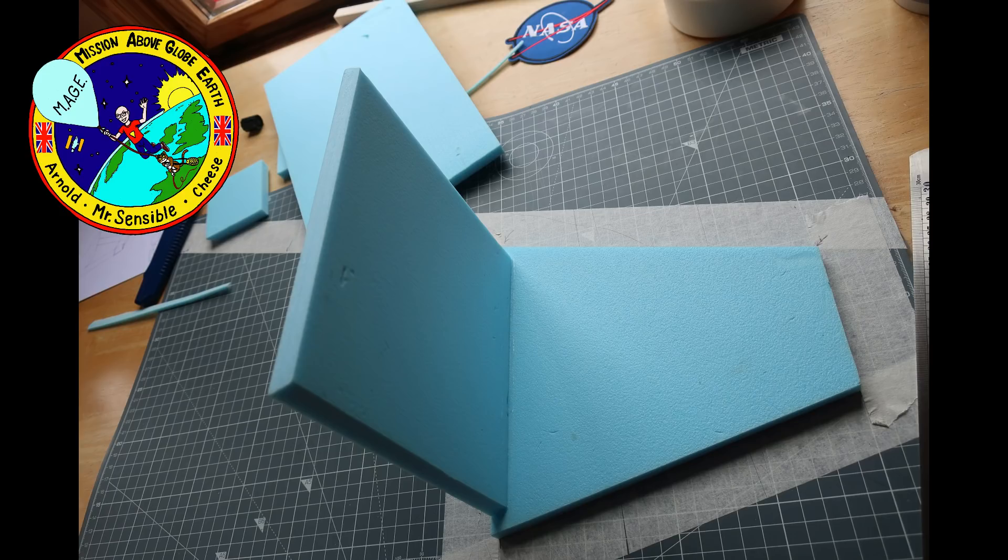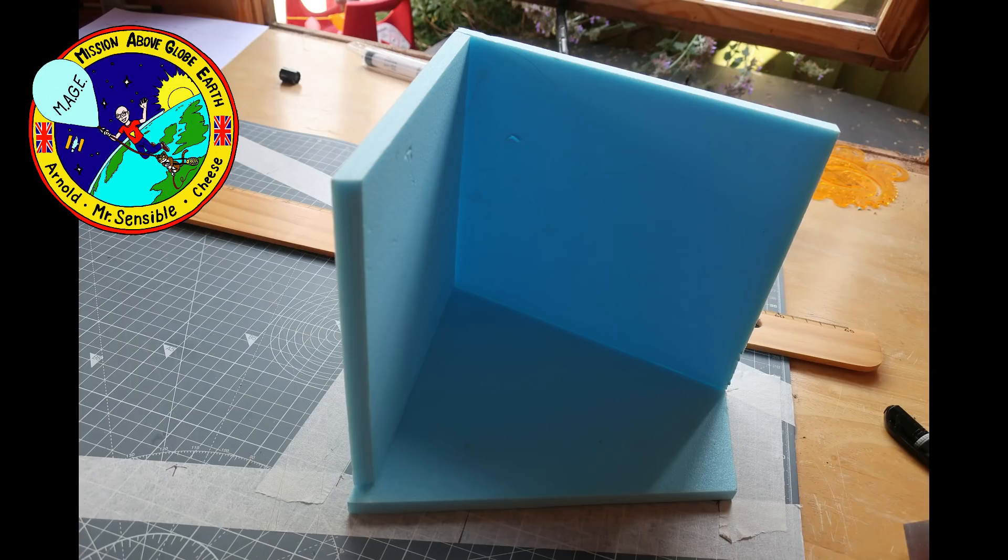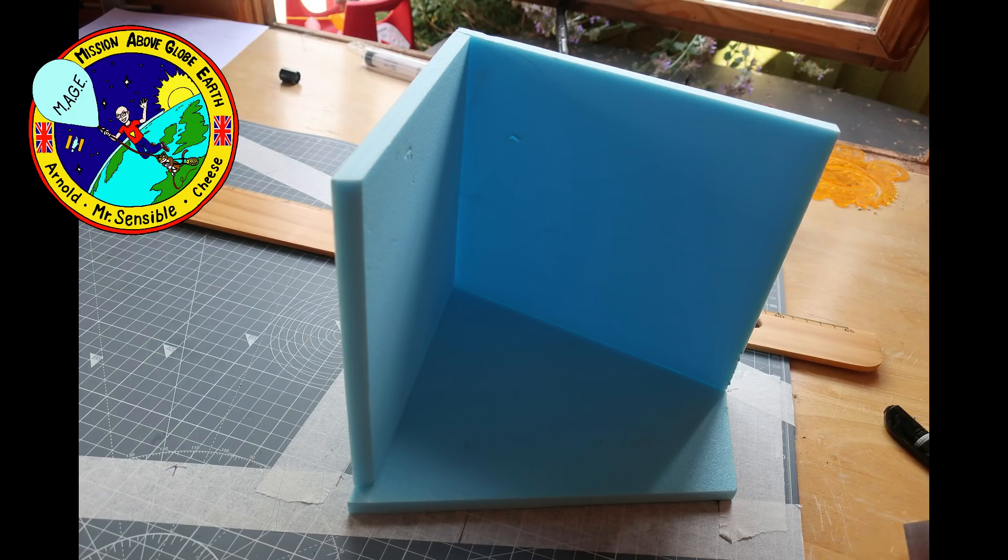So we need to install the foam. The foam itself will help insulate all the equipment that is inside. The reason we want it as light as possible, of course, is so that we can go as high up as possible. A special glue is selected that won't dissolve the foam and yet will maintain its strength when it's down to minus 40, 50, even minus 60 degrees centigrade.